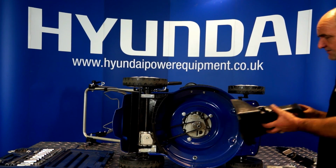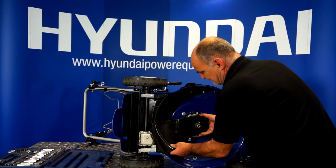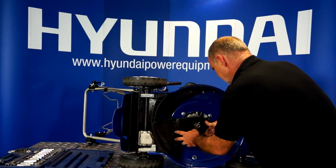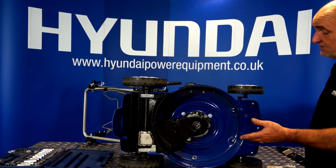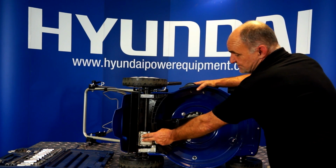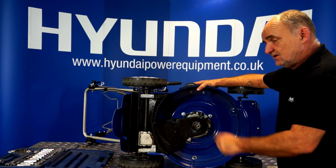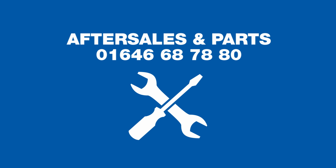When you come to put it back together, simply the reverse of the way you took it apart. Replace the covers back into the groove. There we are, nicely located. Back in with the two bolts, back in with the screw, back on with the blade, exactly as in the reverse method of the way you took it off. And try the drive again. Should you still have no drive, then I would suspect that the gearbox itself has got something sheared in it. If that's the case, ring our after sales department. That would be 01646 68 78 80.